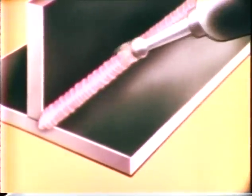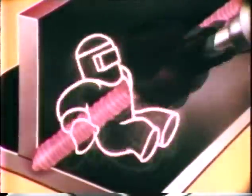The use of peening is the application of a balancing force to prevent distortion in a different sense of the word. By peening the bead, we actually stretch the weld metal, counteracting its tendency to shrink as it cools. When we use peening, shrink really takes a beating. Look at him. He's groggy already. Peening takes the fight right out of him. But don't overdo it. Too much peening may damage the weld metal.